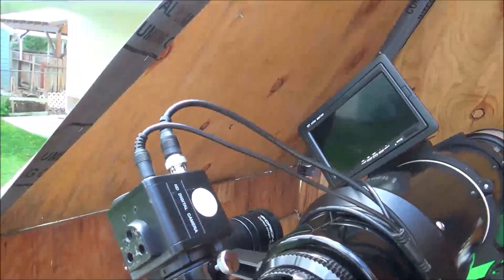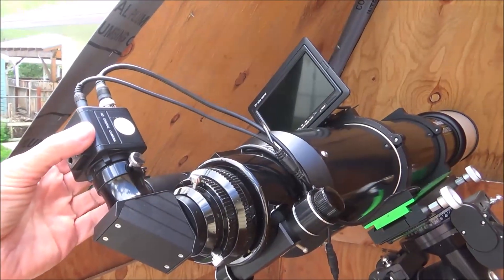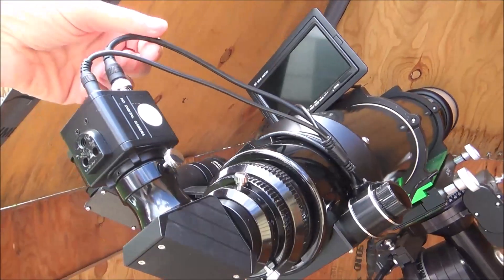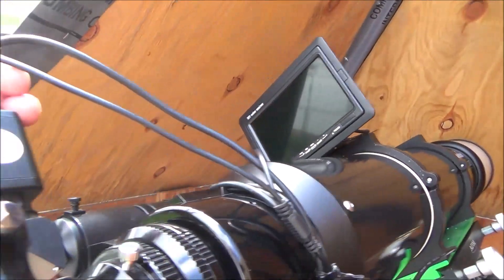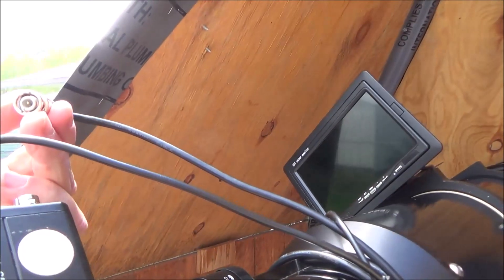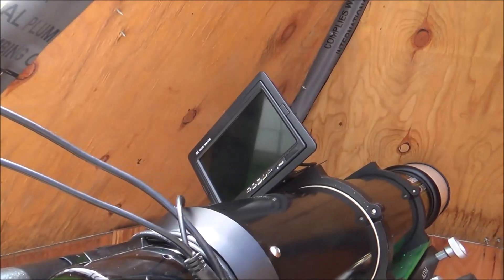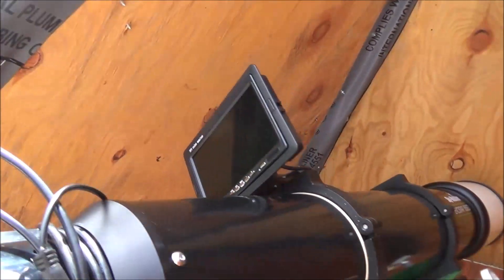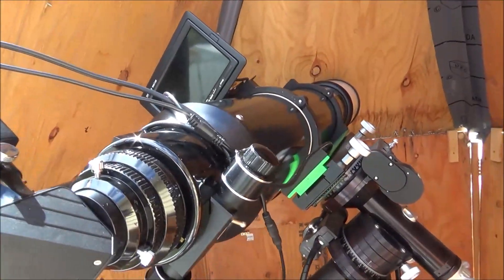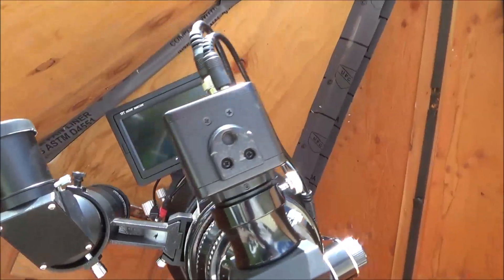Not being a wireless setup, there's a lot of cabling that goes with the REV2 imaging system: 12-volt power to the camera, a feed that goes to the TFT monitor — what looks like a serial-type feed with a ground, shield, and signal line. There's power that comes up to both units, the imager and the display. I think I've done a more elegant job of routing the cabling this time, but you never know until I swing the scope through its full work envelope.